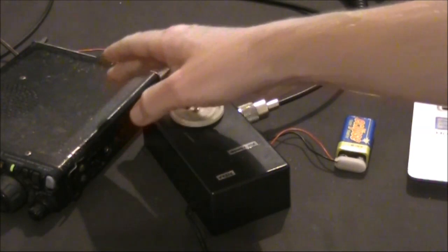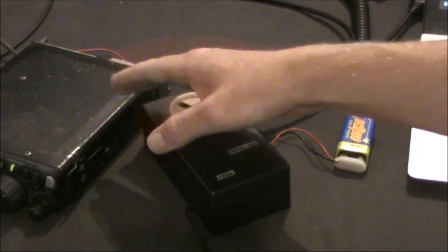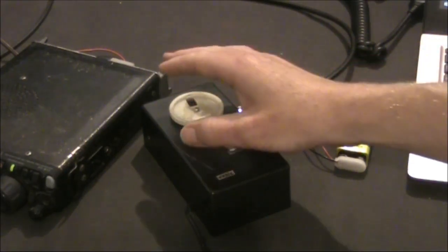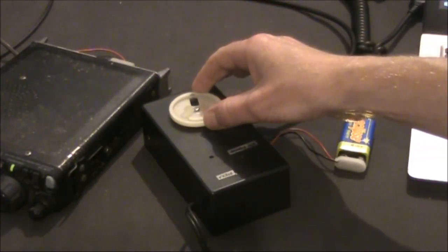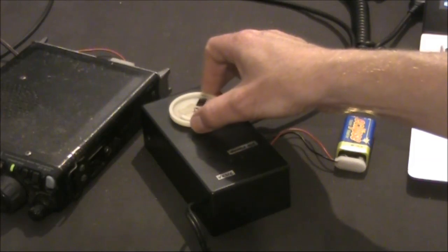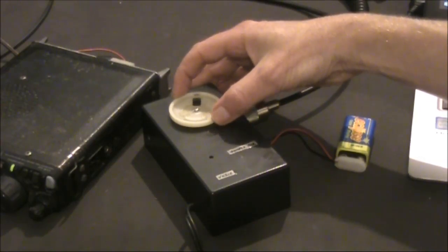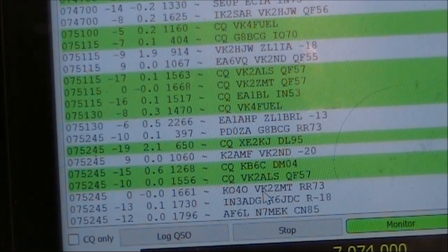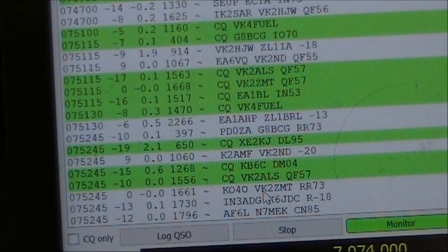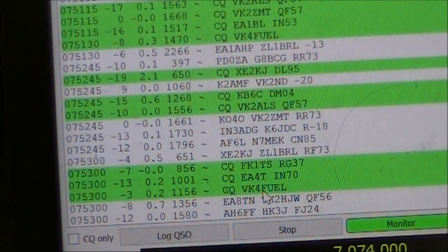We've got the receiver set up. This is an FT817 on 7074. I've adjusted the IF shift so that you can hear zero beats better than normal. The important thing is to get a zero beat by adjusting the variable capacitor — in series with the crystal it pulls its frequency slightly, and you want a null, so you go above and below and eventually reach a spot where you don't hear anything. I've got the WSJT-X software set up, and it's just before sunset where there are some good conditions on 40 metres. As you can see, a fair number of stations are being received on FT8.